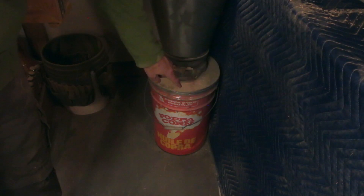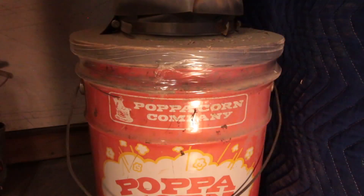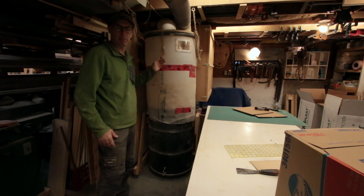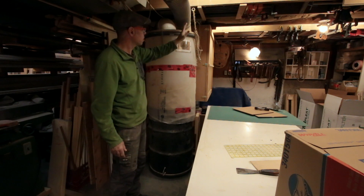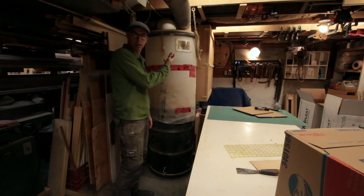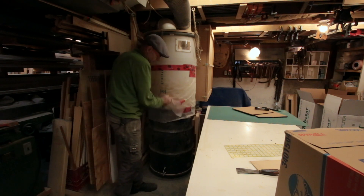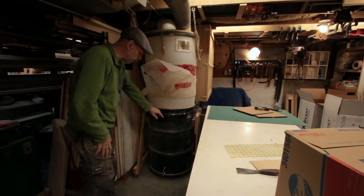Below my cyclone separator I have this small drop can, which takes about three to six months to fill up with sawdust. It's just sealed on here with some flat twine. The bulk of my dust collection happens at my primary separator. I've basically recreated the same sort of thing that's happening in the cyclone — the airflow comes down from the center and the chips come in at an angle through this pipe. As they come in, they're forced into a downward spiral that spits them down into the lower can. It's got a simple skirt here made out of a paper barrier — I just lift that up, and the lower barrel is sitting on a dolly.